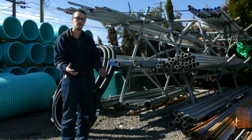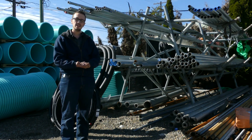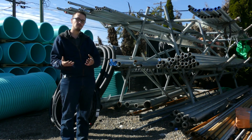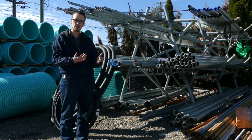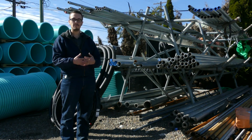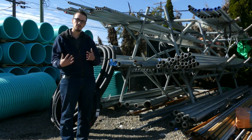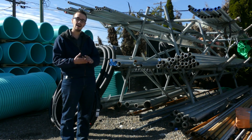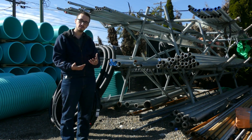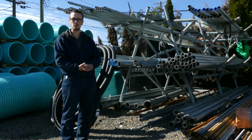Just to give you an example: your typical brass check valve, which is no doubt the most common out there, is rated for only about 600 feet, whereas a ductile iron check valve is rated for upwards of 1,500 feet or greater. So be aware of that when selecting the other components outside of just the drop pipe itself, so that you've got strong connections and don't run any risk of things falling down the well.